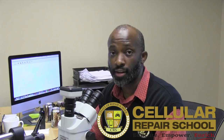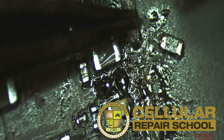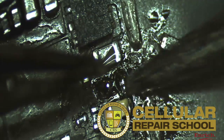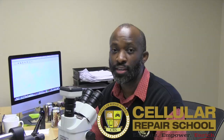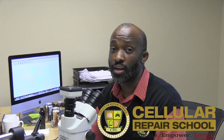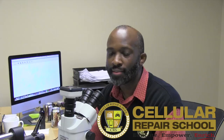You can take the jumpering approach, where you basically jumper past the fuse. What you're doing essentially is taking the fuse out of the circuit and bypassing it. The problem with that approach is that the fuse is there for a reason — it's there to protect the circuit. So if we don't put a fuse back, and we have that same problem of a voltage drop and current surge, we run the risk of damaging our board to an unrepairable place. Some people do choose to do it that way — it is a repair that works — but it's not the best in my opinion.